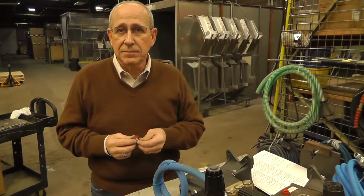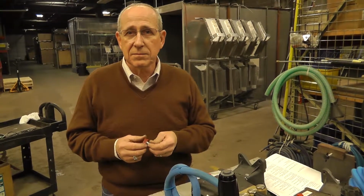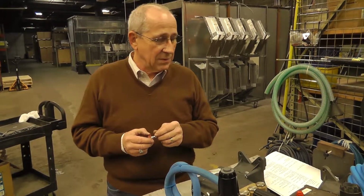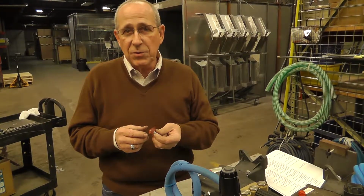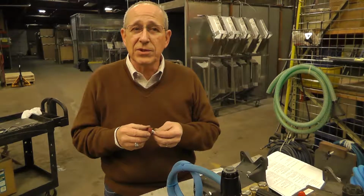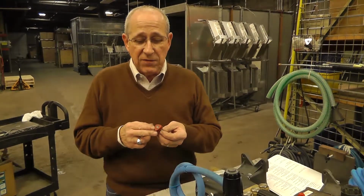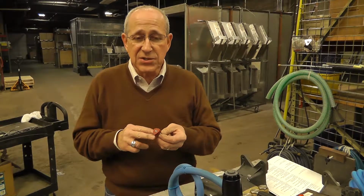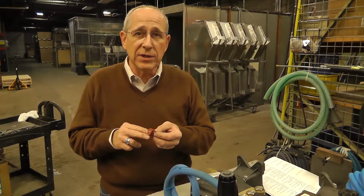Okay, Al, so first question for you is when somebody calls up and they say that their pressure washer has no flow or no pressure, what would be the first things you start to check? Okay, with low pressure or no pressure, you'd want to go out and make sure that you have fluid coming through the nozzle. If you have enough fluid going through the nozzle and they're saying low pressure, it's a possibility that the nozzle is worn.